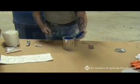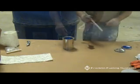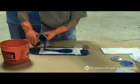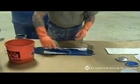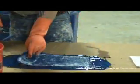After the joint has fully cured, lightly grind all previously abraded areas. Dust them off and wipe down the area with an acetone-soaked rag. Cut several dozen pieces of fiberglass mats to lengths of approximately 24 inches. These mats will be used in the next section, but it is important to do this before mixing the resin to give yourself more time to work with the resin before it hardens. Mix one pint of catalyst resin at a time, starting with a small amount so the mixture does not cure before applying it to the sump.